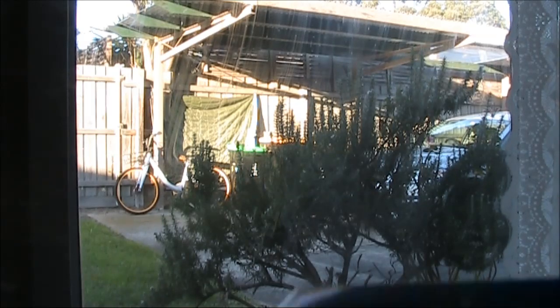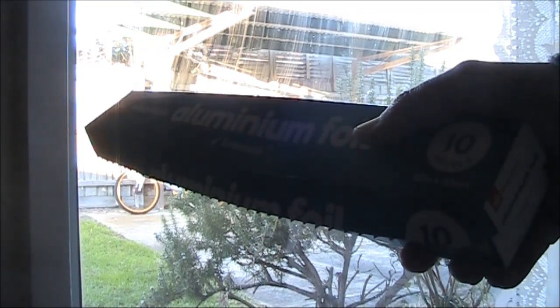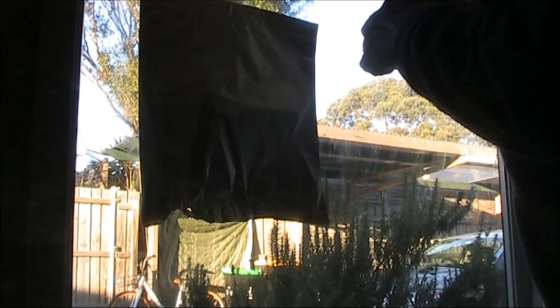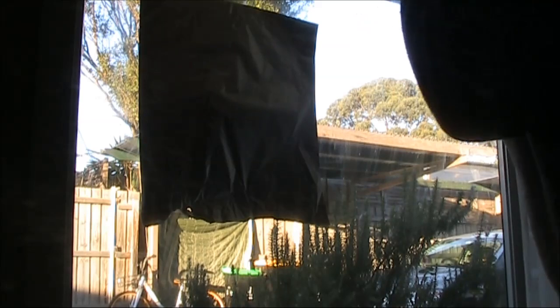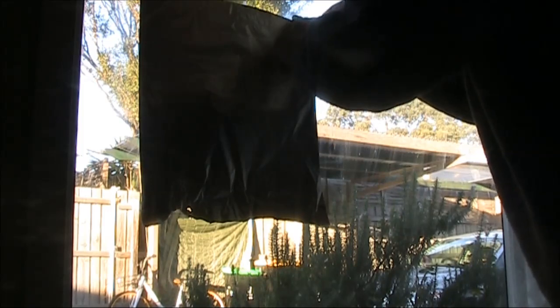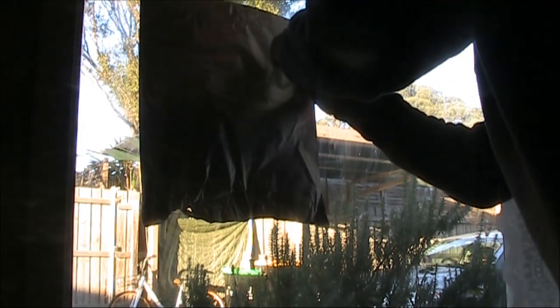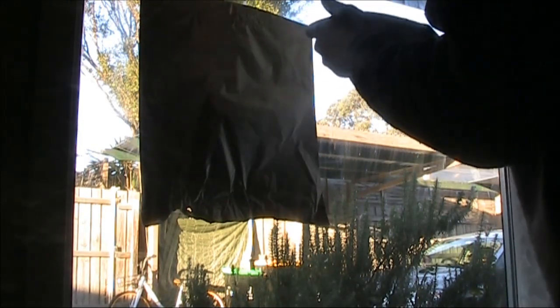You need access to both the inside and outside of the window, plus some aluminium foil, which will form the capacitor's plates. I'm going to try a piece of foil about 30 by 30 centimetres. You want it to be as close as possible to the window, so it's a good idea to tape it all around. Try not to crinkle the foil — get it as flat as possible.